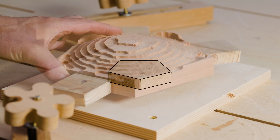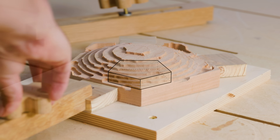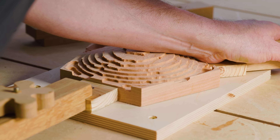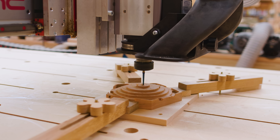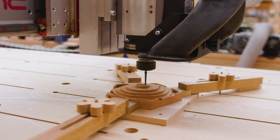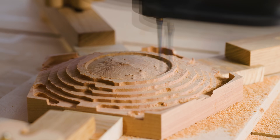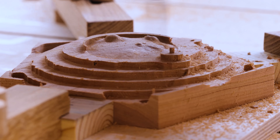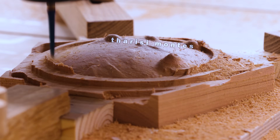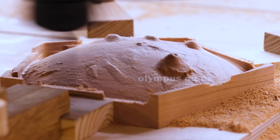Then I can put them back on the jig. Having the jig allowed me to do all 12 with one bit in the spindle, which was a three-eighth-inch flat bit. Then I could come back and put the pieces back in place and do a 3D carving bit, which is an eighth-inch ball-nose bit. This is where having the tabs have a direction was helpful — I could get the piece back in the right orientation so that the different mountains and craters all lined up with the two passes. Each one of these finishing passes was taking a little more than 17 minutes.